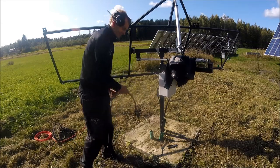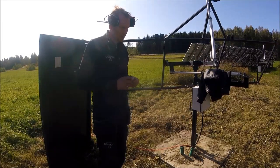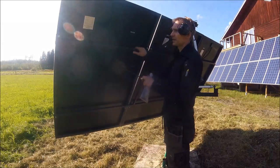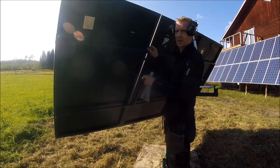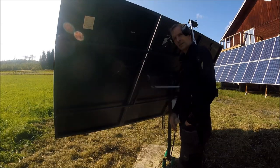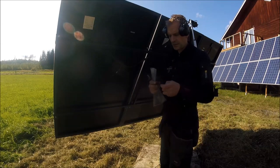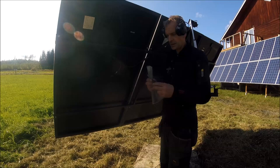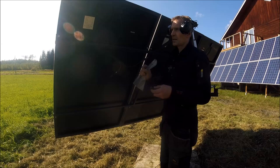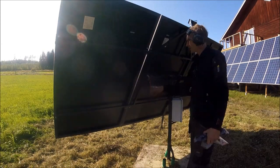I just need to pull this through with a 12 volt supply for the solar tracker. Now I've got the wires in the conduit and I'm fitting the solar panels. I have the panels in place, fixed with four M8 bolts, and now I'm going to put on the MC4 connectors. These are quick-fix without any soldering or crimping — I just cut the cable, strip some clean wire, and push it through.